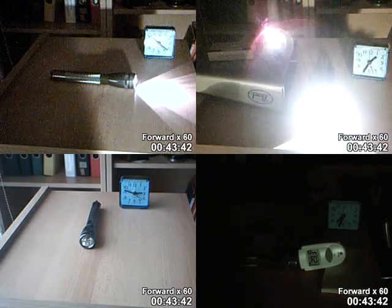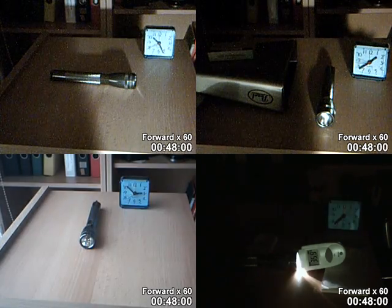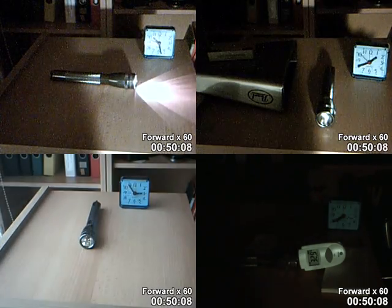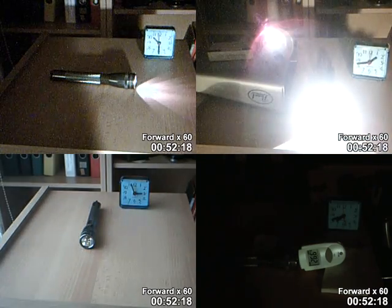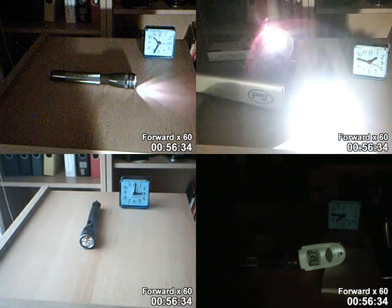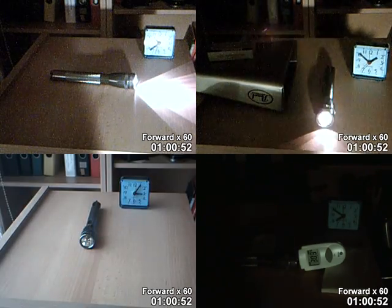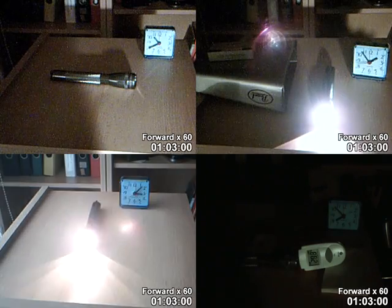As the lamp goes on, the reflector starts expanding from the heat. It expands until it has generated enough force to break the welded spot. Depending on the quality of the weld, the lamp either goes off quickly as the contact surfaces jump apart, or it goes off flickering as a bridge of molten metal is formed between the contacts which burns out.